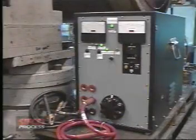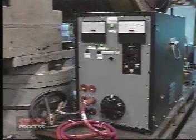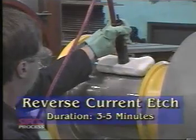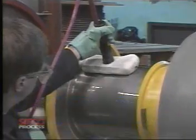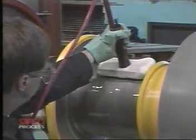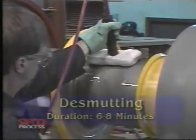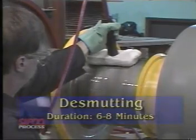A specially designed selective plating power pack is used to supply the DC current necessary for surface preparation and plating. The next step is reverse current etching. This operation removes corrosion products, smeared and contaminated surface material. Etching is completed when a uniform, dull appearance is observed. A de-smutting operation is now performed to remove residual carbon which develops during etching.